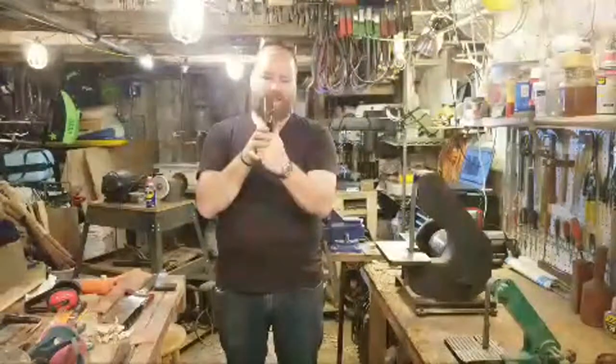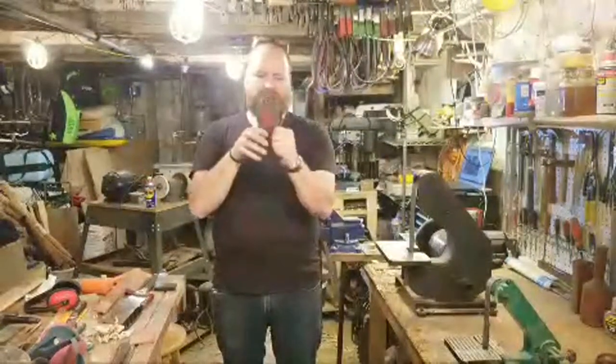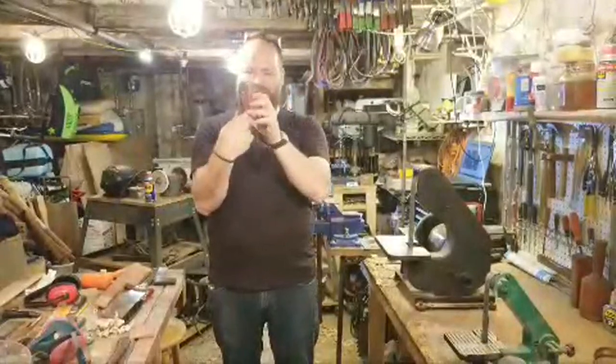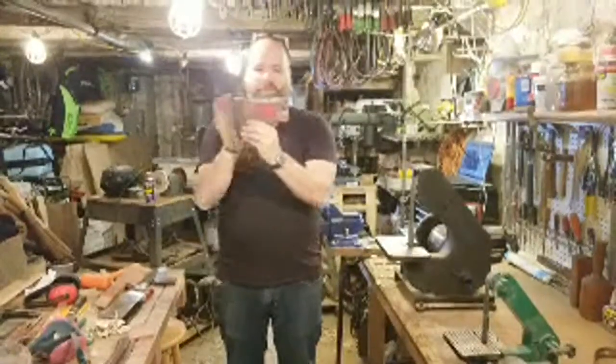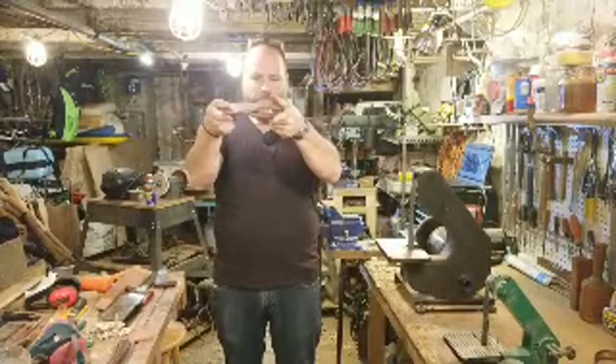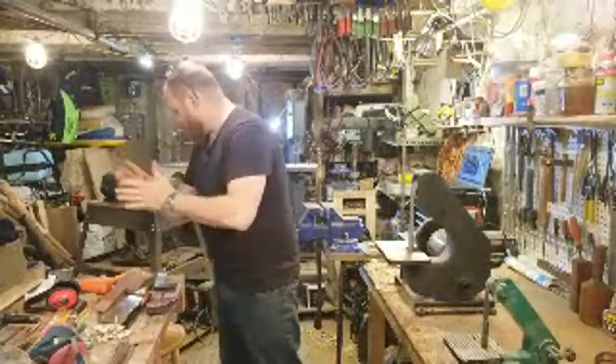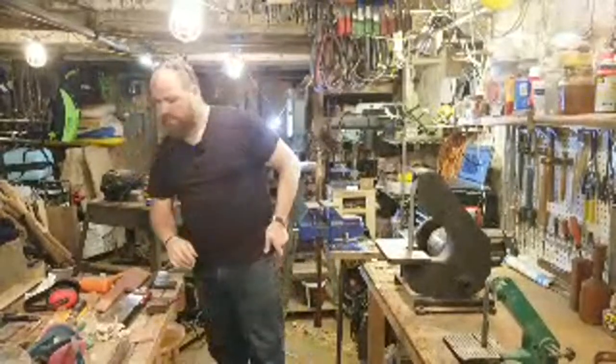And I can see that this is pretty much straight in. It's definitely narrower this way, by about 1/8 of an inch. So as it goes up, it's going to be able to flush out this way. I'll get the wedge in, and it kind of opens up the bottom, a little bit of an hourglass shape, which should make it fit really nicely into the handle.